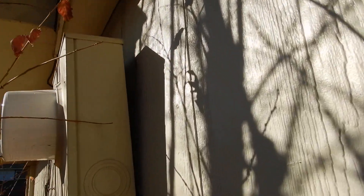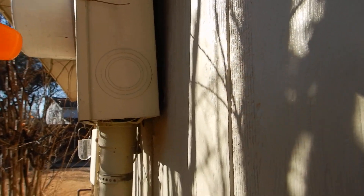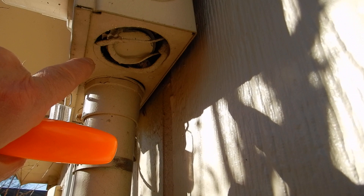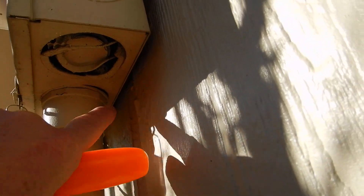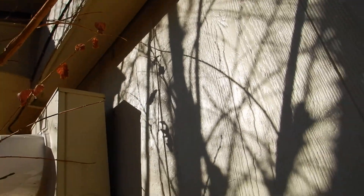We are on the south side of the home. This is an electric meter, and the electric meter box is pulling away from the house, away from the structure. The bottom of the box is all messed up. You think water can get in there the way it's pulling away? It's not properly secured to the structure and it's not properly sealed on three sides, below grade. Another thing I'm having trouble with is finding grounding and bonding.